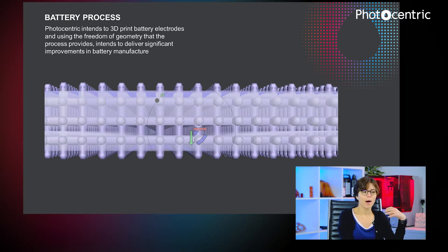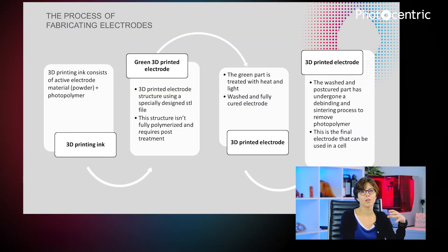And just a little bit about the actual process — how does it work? The process is a photo-curable process. We will use our LCD-based 3D printers and photo-curable inks. The photo-curable inks consist of a photo-curable polymer matrix and the active electrode powder as well as conductive additives — this gives you your 3D printing ink. The LCD screen displays a pixel which cures a voxel of your ink and you build your electrode layer by layer.